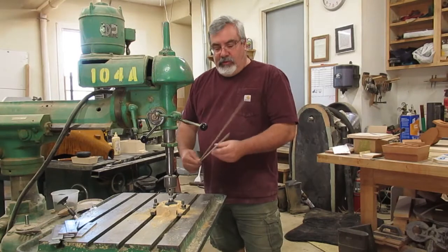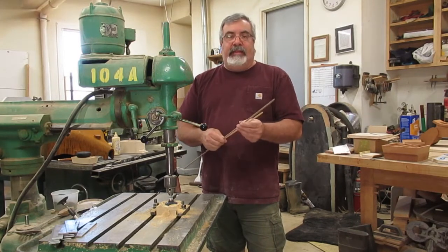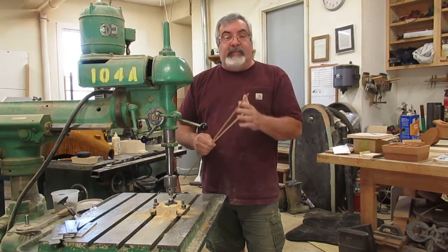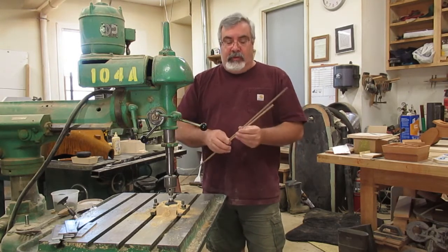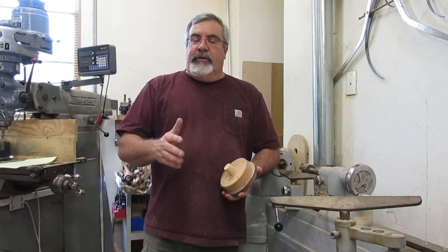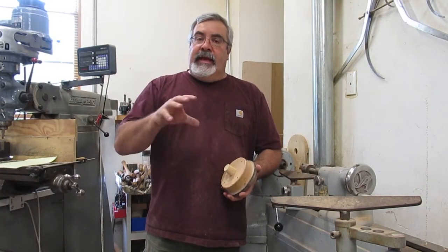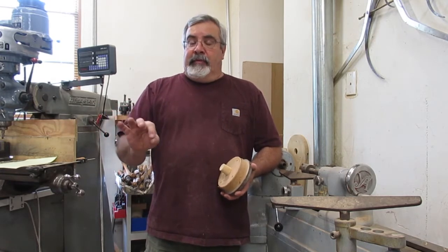Okay guys, done on the drill press. I got 2 pieces that should give me enough. I gotta cut these, I think they're like 1 1/8, something like that. I'm not gonna cut these just yet. I'm gonna wait till I get all those glued on. I'm just getting stuff ready to do a gating job, okay? Next step I'm gonna start making the runners, alright? So hang tight. Okay guys, continuing on with the gating system for the Y pipes that I'm making.